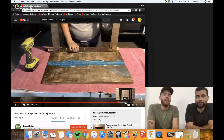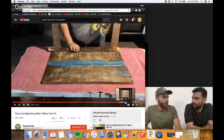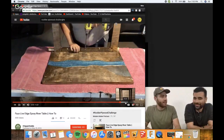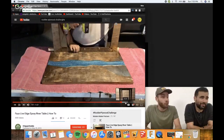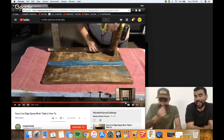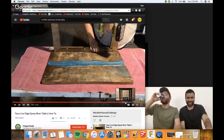I used a spacer piece of wood so that the 2 legs would be the same distance from the back and the sides for the front and the back. This is pretty easy, just line them up, and then I drill them with pocket holes. I repeated the same process for the front set of legs, and I quickly cut a little spacer bar for the middle and attached that with pocket holes as well.